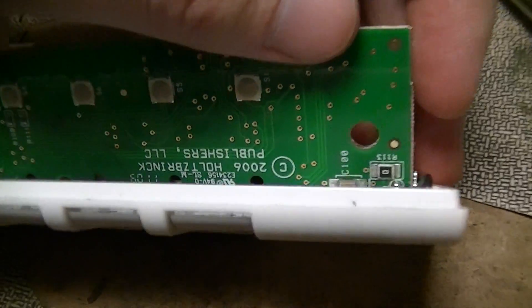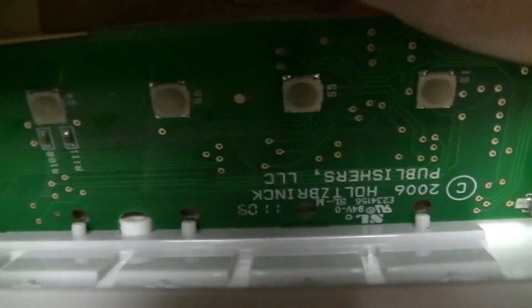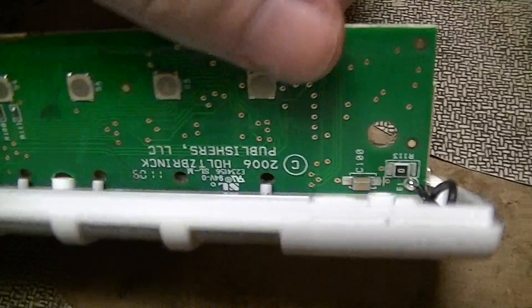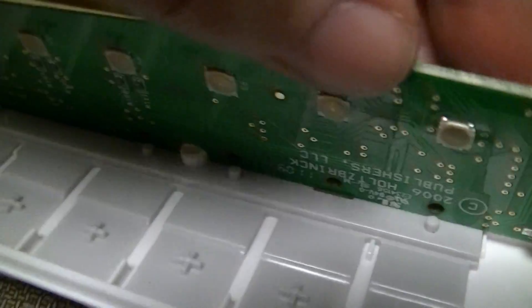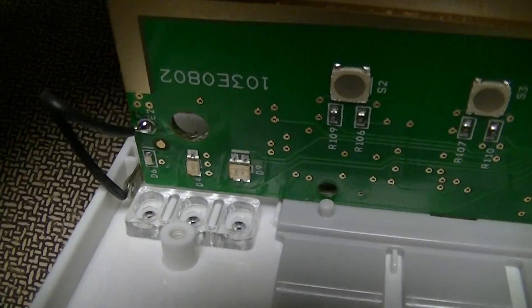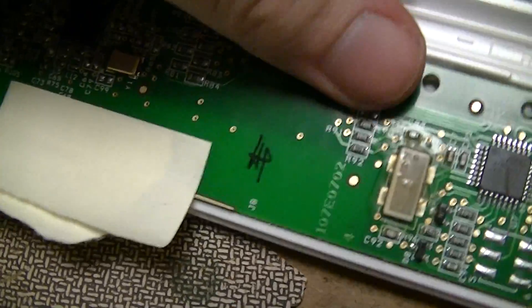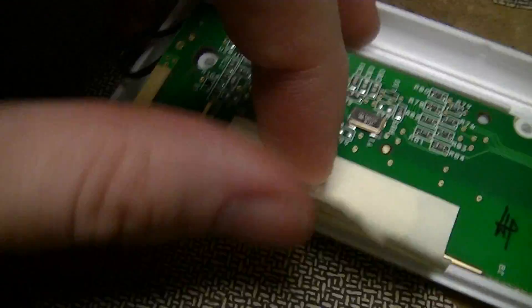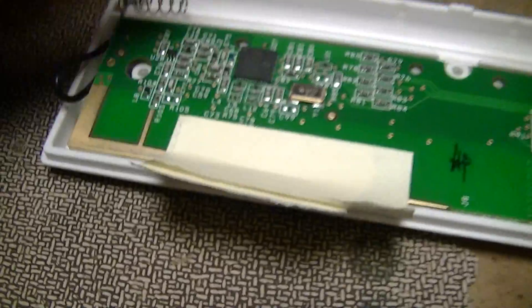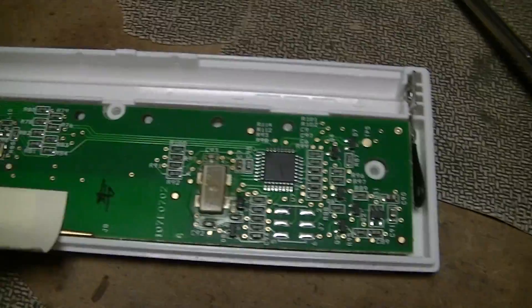I think that's a 1206, IP805. Those are actually proper PCB-mount switches — not the dome type ones. And those are the three LEDs, one of course being bi-color for the vote status. The marking with seven E's or 7702 is probably just a board art delineator, which is why it's etched in the copper, and the other one was for the silk screen. There's just an antenna right there. And these sticky notes are just to cover over the ID serial number, so that this thing can't be tracked.